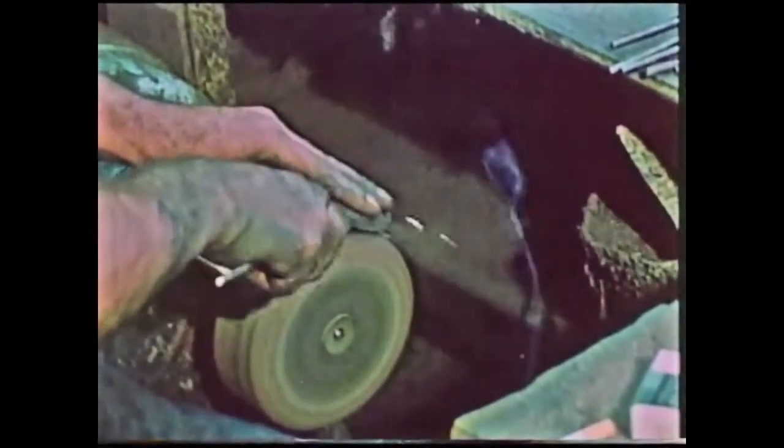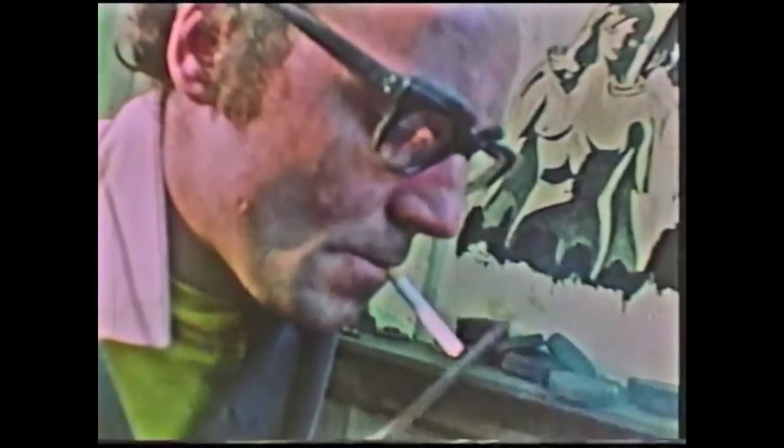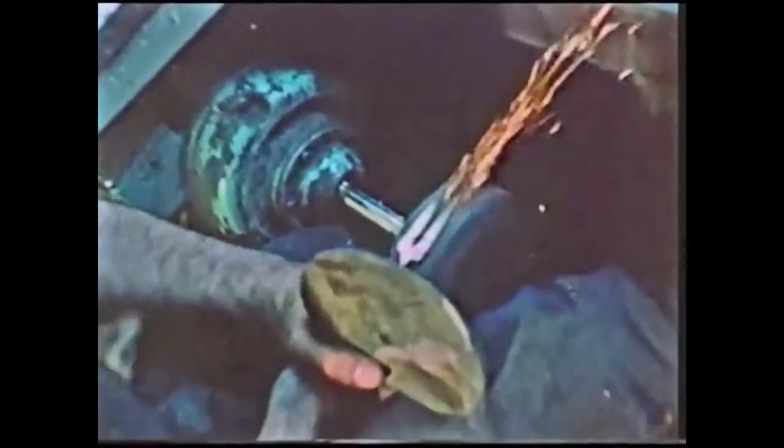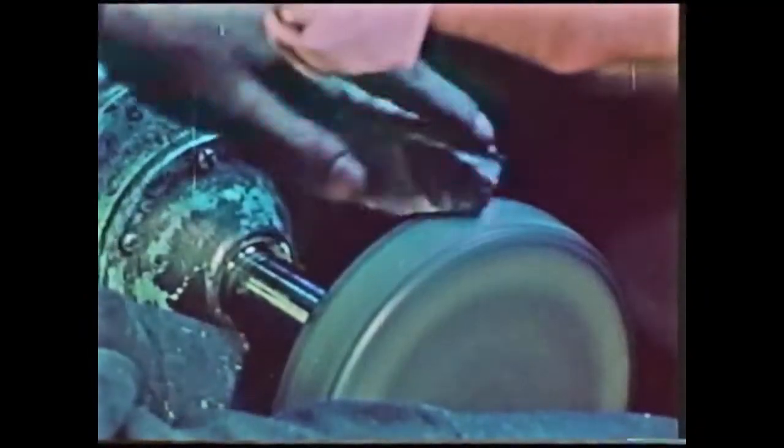The next process to this is a finer still process. Instead of an 80 grade, we break down to a 120 grade emery, which is far, far smaller. We grease them on this with laying grease and compo on the glazer, breaking it down to a very smooth surface. We go over the same process again, grease glazing the prongs, follow on with grease glazing the shanks, and bringing them up really smooth and white.